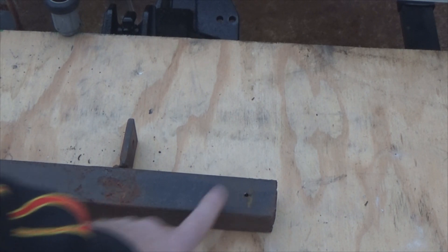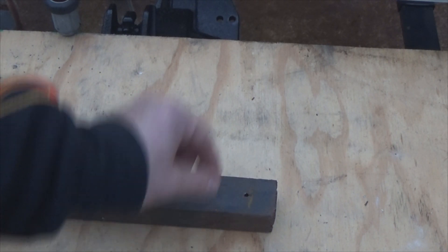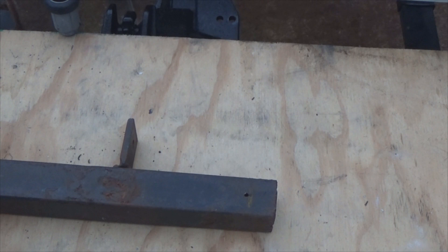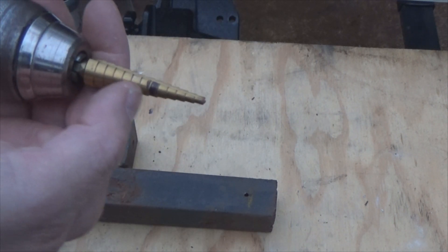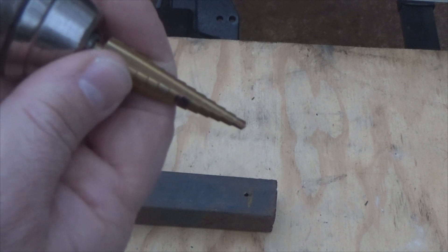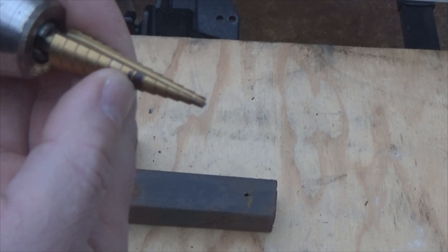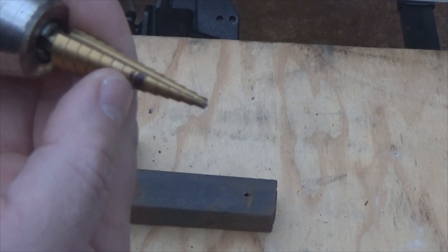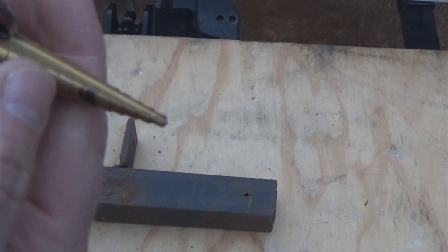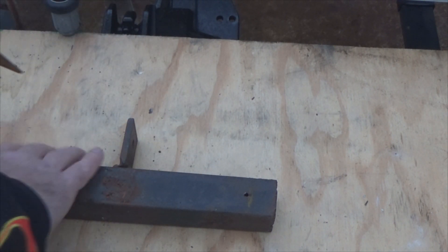If you're drilling alternating sizes like quarter inch and three-eighths back and forth, you drill one single-size pilot hole and the step bit lets you stop at whatever depth for whatever diameter. So first I'm going to drill down to the quarter inch step — just short of the black stripe — that's our quarter inch hole. Then I'll drill on down to the next step, just for demonstration, to show you how it takes that black mark off.